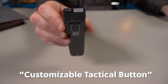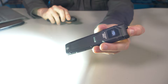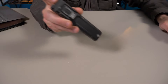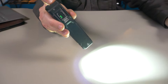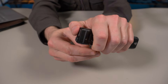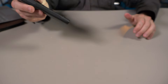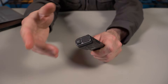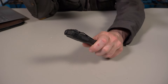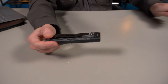Now let's talk about the customized button — that's changed from the mode button on the EDC-27. On the EDC-27 you'd half press the mode button for turbo and then fully press to reach strobe. There's no more dual stage on this button — it's just a single press, and it's going to be whatever you program that button to be. Right now I have it set to instant turbo. You can also program strobe. To do that, press and hold the customized button, then fully press the power button, and now you've changed it to strobe instead of turbo. Having to choose one or the other is a big step backwards, though it's easy to switch between them.